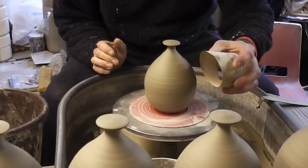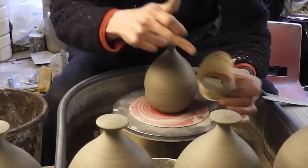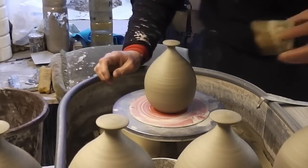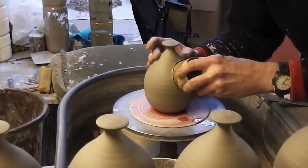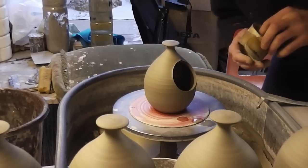Now what I'm going to use, like I said before, is just a can — it's been cut off at 45 degrees so it's quite sharp. I'll just dunk it in a bit of water, then go in, push that in, twist it, and out should come a perfectly round hole, like so.